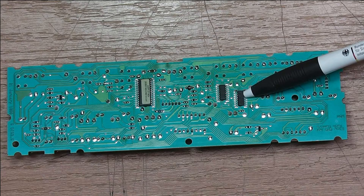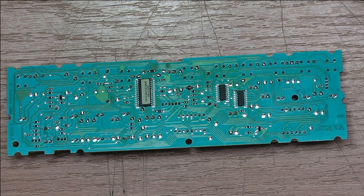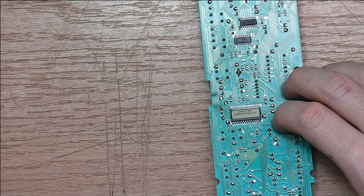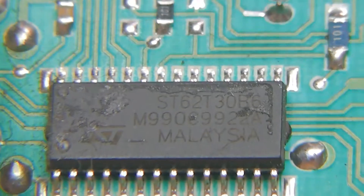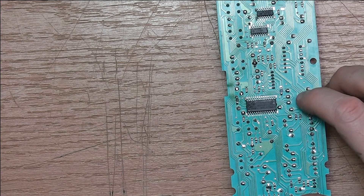This one is a ULN2003, which will probably handle the seven common cathodes of the 7-segment display. What I think is the microcontroller has been covered up with a sticker that reads STI3F127.hex and below that 28080748-6IND-D1CAT. So I'm going to peel that away to see what kind of microcontroller it is. And yes, this is also an ST brand microcontroller — it's an ST62T30B6. The date code is also 99 on this one.